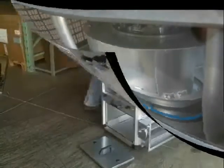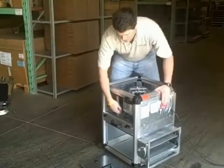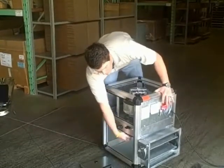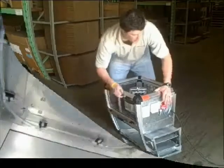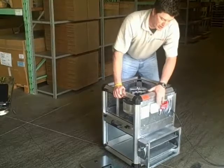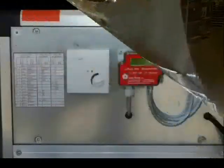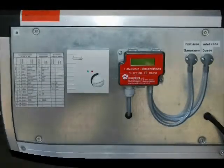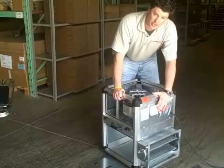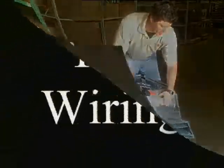On the front of the module we've got our pressure sensor. This will read pressure from the inlet pressure ring. Also in the inlet area there's another sensor that will tell us the difference. Next to that is our enable potentiometer switch, which controls the fan on and off. It has failure indicator lights as well as a potentiometer to control speed and set our set point.